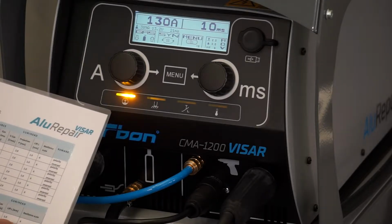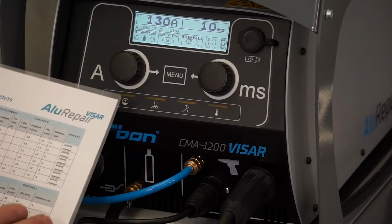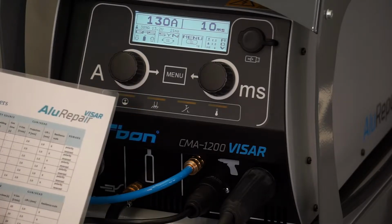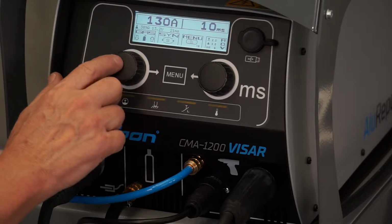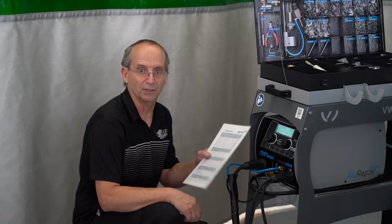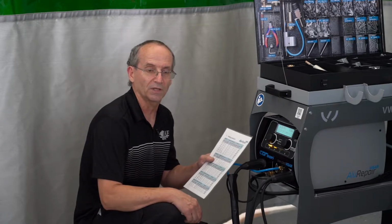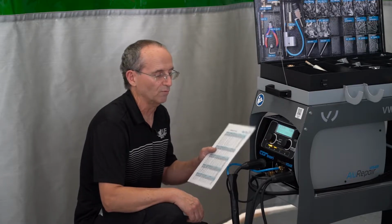So you're going to see a lot of stuff on these charts repeat themselves over and over again. The majority of stuff that gets changed on this is going to be amperage and timer. Double check your chart, read across very carefully, make sure that you're setting them all the same, but you don't have to keep setting lift over and over again. You don't have to keep setting spring tension over and over again.